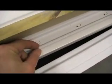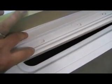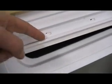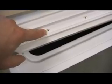As I suspected, this lip here comes a little too close to the edge. I want this to sit nice and flush with the edge of the lid, so this bump-out is going to have to be cut off so there's a flat surface for the collar to attach to. This is pretty soft, thin plastic — I'm probably going to use a utility knife right down in this crease so I'm left with a flat surface, and it'll still allow us to reattach the cover to the lid while remaining smooth on the edge.